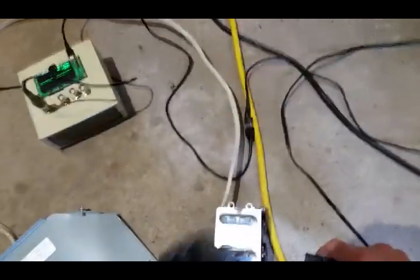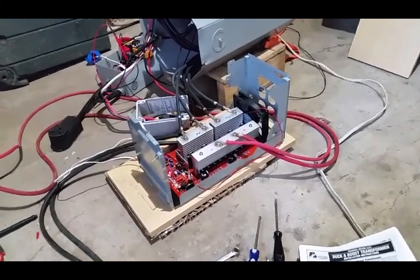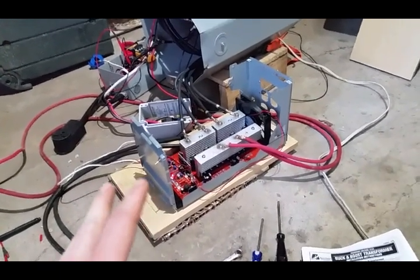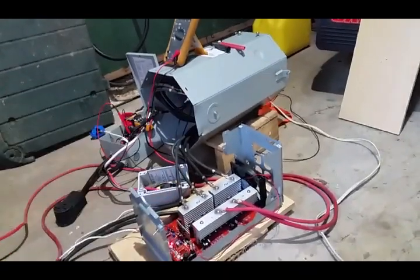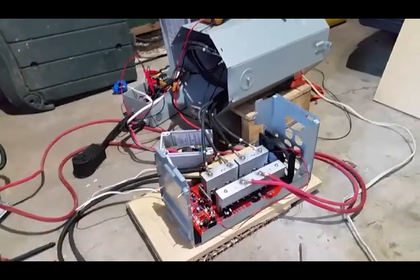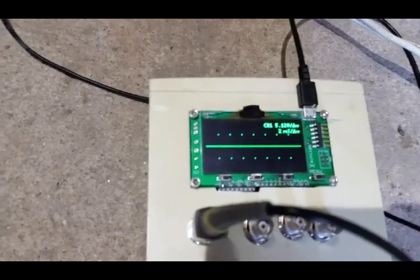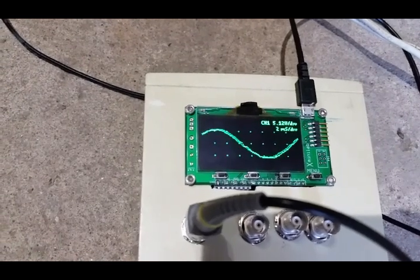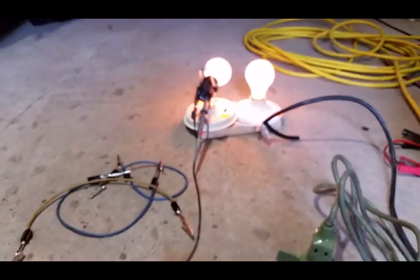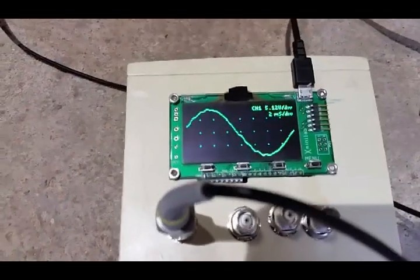I've taken out some capacitors to reduce the current draw. So I'm going to unplug this from the wall and plug it into the inverter, which is turned off right now. It has a nice ramp-up feature — though that ramp-up feature might screw up some appliances and electronics. I do recommend using the ramp-up feature because you can get a big surge current to magnetize that big transformer. Just shut off your breaker when you're doing that, and if you're going to power off the inverter, power off the breaker first — that way everything stays standard and normal for your appliances. Okay, I'll flip the switch. You should hear the humming sound. There we go — there's my lights on. That's what the sine wave looks like. There's a little bit of noise, but generally that's a really nice sine wave — that's a pure sine wave inverter. That's pretty much as good as I think I'd ever need.